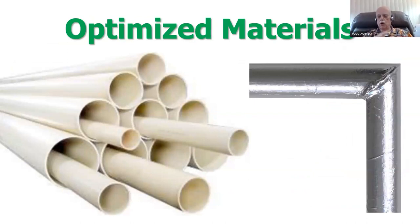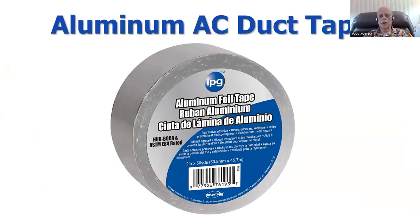And you can build square corners, angle cut it, and glue it together. Makes great magnetic loops. And it works just as well as copper pipe. These are the optimized materials for building magnetic loops, or other kinds of antennas for that matter. I built all sorts of antennas out of plastic, PVC pipe, and aluminum foil tape. And here's the optimum material to build plastic antennas out of: aluminum air conditioning duct tape. You can get it on the internet or at your local hardware store very readily.